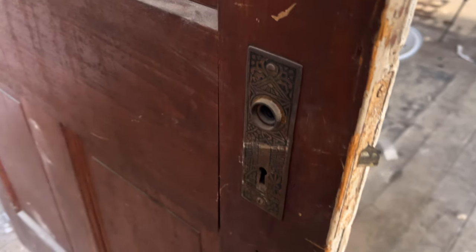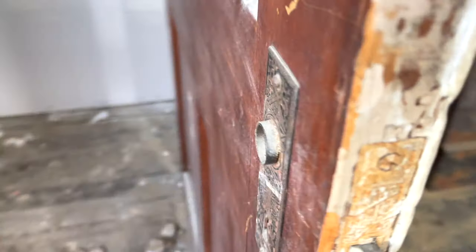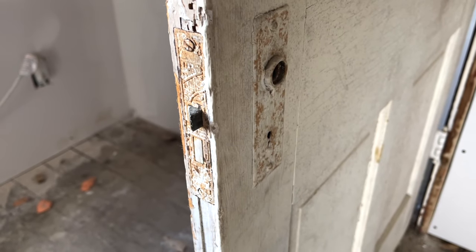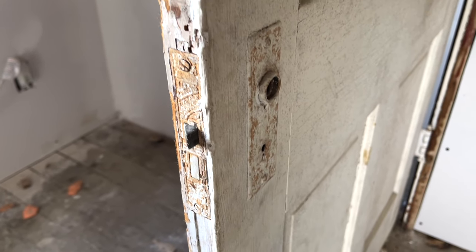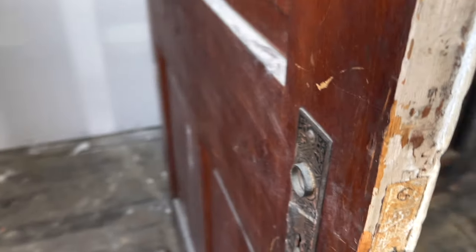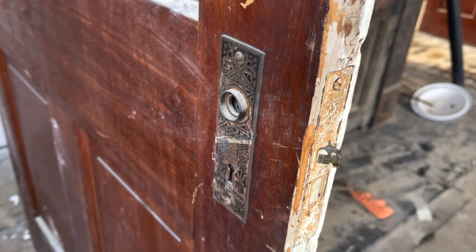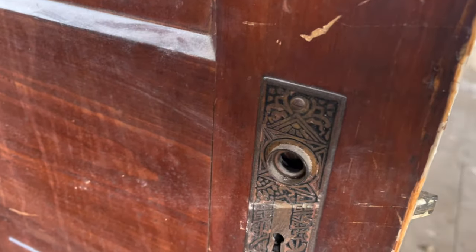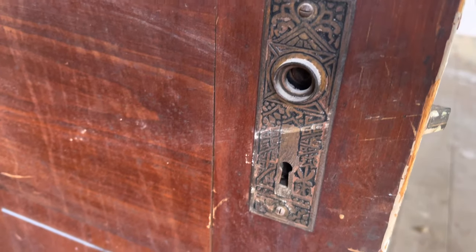The plaster in the closet is on the brick, so we left it because it's incredibly hard to remove — you have to use a grinder with a special tip so you don't destroy the brick. We just mudded over it; they call it marrying plaster and drywall together. The closet door I'll need to take down and peel the paint off the white side, and I'd love to try and match the stain to the original color, though the stain is quite different nowadays.